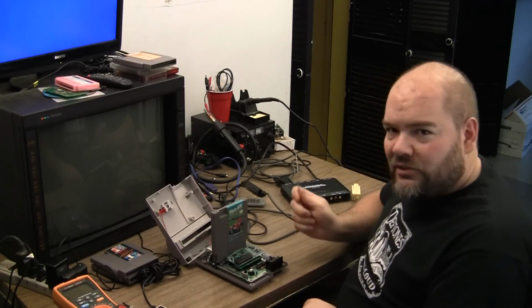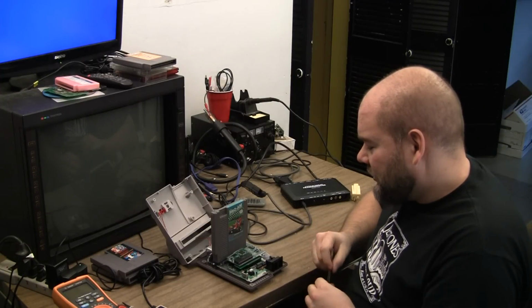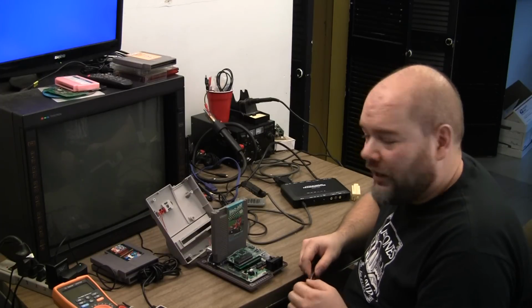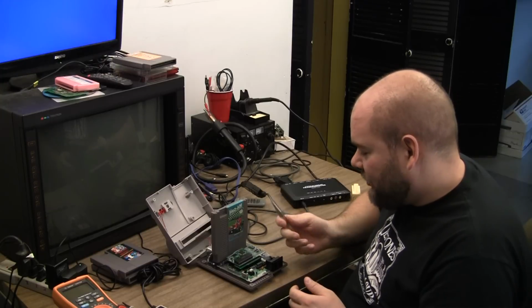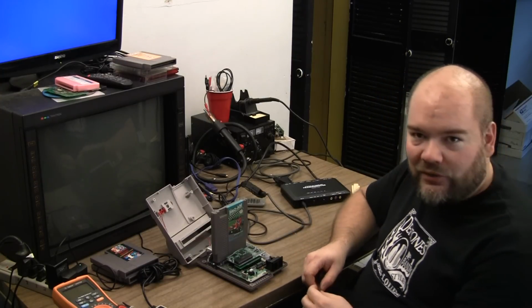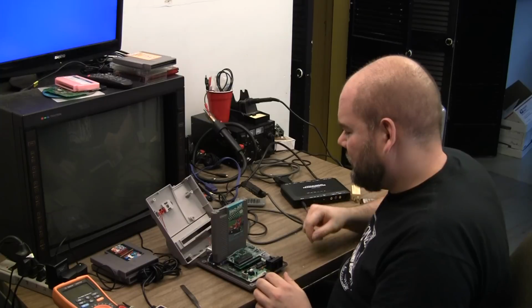And I think maybe since he's using the xrgb mini, he's not going to care about composite video output on the multi-out, so what I might do is just wire composite sync to both pins on the multi-out and then just bypass composite video output altogether. I don't think this customer would mind, but it might be something I might want to mention to other people that are going to have RGB out and then use the FrameMeister. And then of course, what's it going to do with the CSY2100s or whatever those things are? I think those will use either, probably. I guess I could hook one of those up real quick and see.